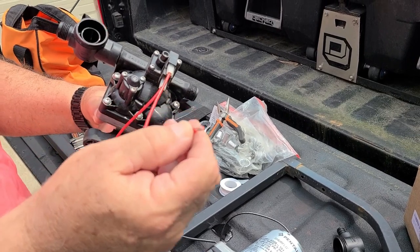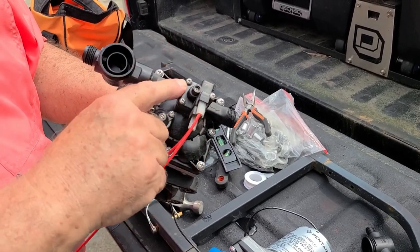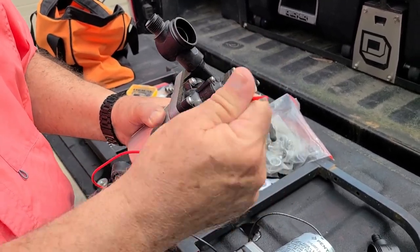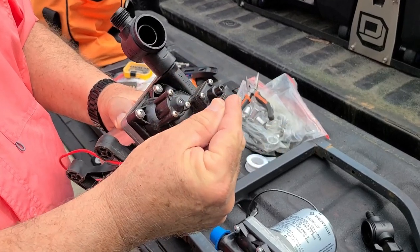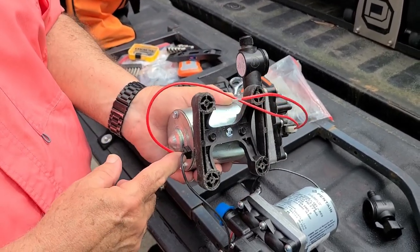Let's get into fixing the water pump situation. As I mentioned, I thought I had it fixed — the water was running, I had good pressure — the only problem was the water pump would not turn off. This is a hot lead going in through this pressure switch. If the pressure is high enough, it opens up and there's no flow of current to the motor. If hot comes through the switch, the motor and pump run. But if the pressure gets too high, this switch is supposed to turn the motor off and open up — stopping power from flowing to the back of the motor.